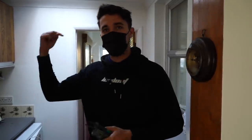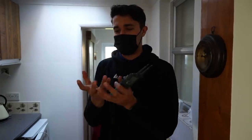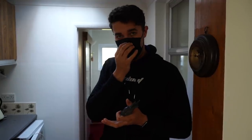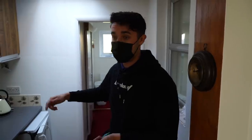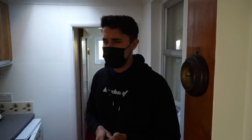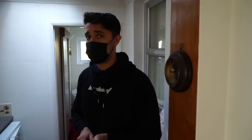What they've basically done is they've run every leg back to the consumer unit, from all the switches and from all the lights, and they've done all the wiring in there. So I just had this big nest of wires in there, like some kind of robin's nest, and they've figured it all out from there, which I guess in a way is ahead of the time, because you could do smart lighting and things, switching off whatever you wanted from wherever you wanted. Like, you want to switch off the light in your toilet from your bedroom? Do it, mate. But it is a really unusual way of doing things.